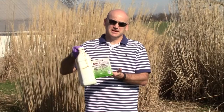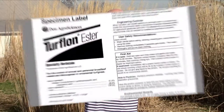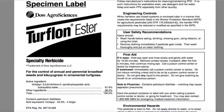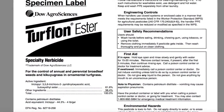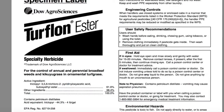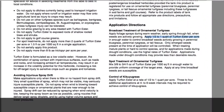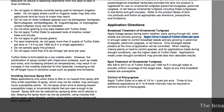All that is left is to read the pesticide label and determine how much chemical to include in your sprayer. On every pesticide label, you will find the rate needed to be applied. For example, we will look at the label of Turflon Ester to find the information we need and finish calibrating our sprayer. The label states that this product needs to be applied at one half to one quart per acre.